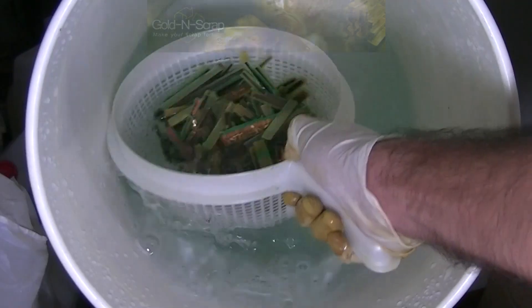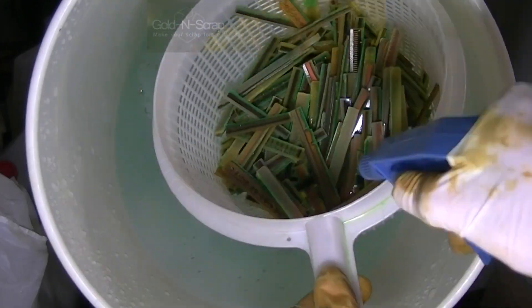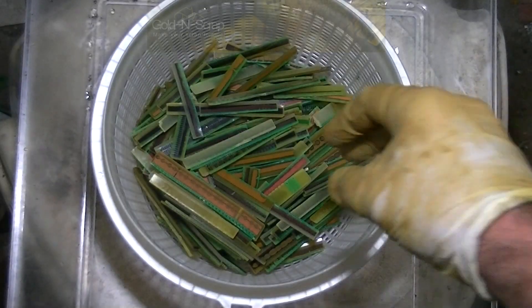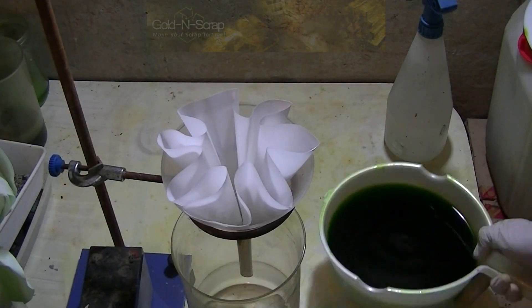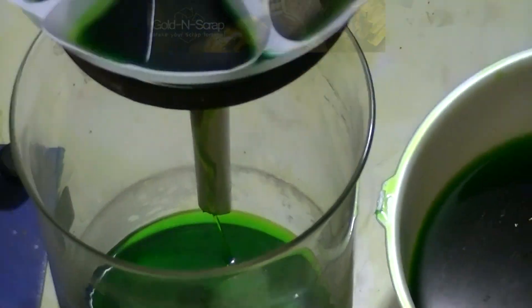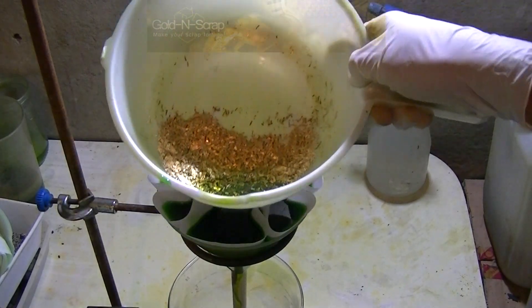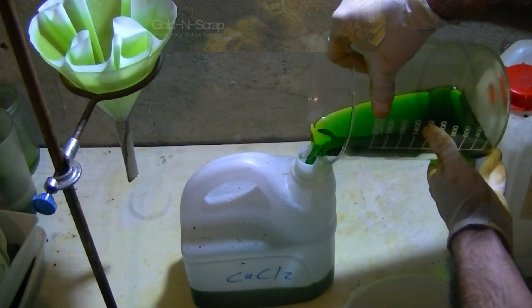Let's fast forward. We still haven't finished with the fingers — it is now set aside to dry completely, and we'll return to that later. Now for the main batch of gold foils. After settling for a while, the bulk of the etching solution is filtered first by pouring just the solution on top. You can see the filtration flow rate is quite fast. Here's our recovery product: nice and shiny gold foils. The etching solution is moved to storage and will be reused on the next batch.